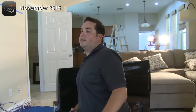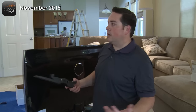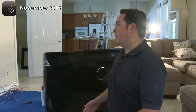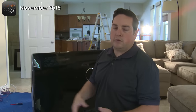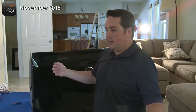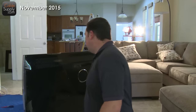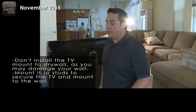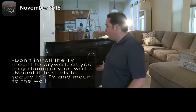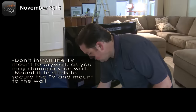Make sure that when you buy an arm mount that you don't just get any arm mount. You don't want to go for the one that fits your TV and has the cheapest price point. You got to look at how far it comes off the wall. We see it every day, people buy arm mounts and they'll put a 12-inch one on a 60-inch TV. It comes off the wall 12 inches and it does nothing on a big TV like that. Just barely moves. So for a TV like this, you need to measure half the TV, and that's how much length you want off the wall at least. So on something like this, you'd be looking at 27 inches for your articulating arm mount.